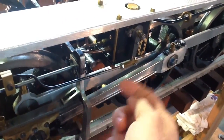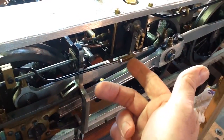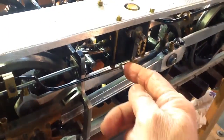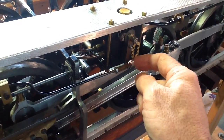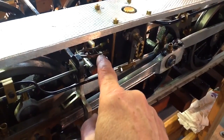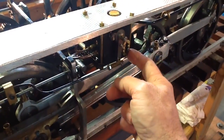It's been a year since I installed the mechanical lubricator and the running board. I like how it looks - I'd run the lines, built the lines, built a little arm and all that. I had primed it initially just to check it, but I hadn't put any cylinder oil in there. So I finally got some steam cylinder oil, filled it up, and disconnected the mechanical arm so I could move it by hand. I disconnected both fittings just to make sure the prime was good and I had oil coming out, and then I could reconnect the lines to make sure oil was supplying to the steam chests.